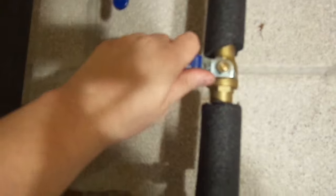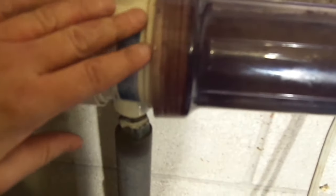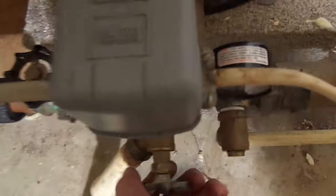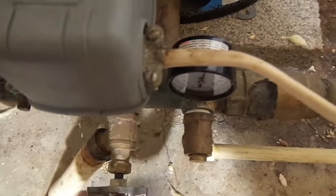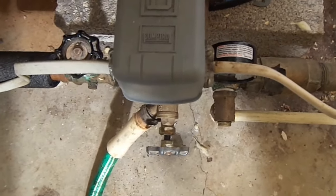As you can see, I have a water softener system — go ahead and turn off the water to that. Open your main line; that'll allow the water to come down through your house, pass your water filter, down to your pressure tank. Turn the valve on that leads out from your pressure tank. I ran a hose over my sump pump — go ahead and let that run.